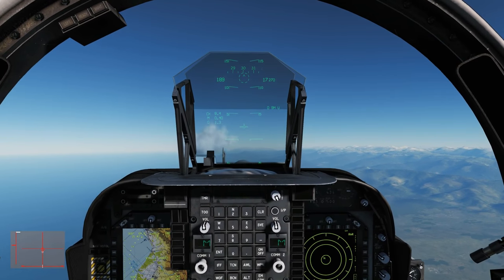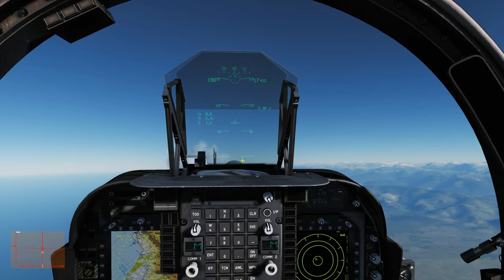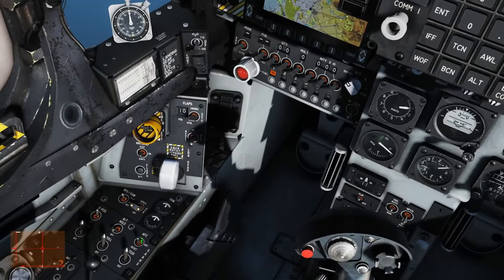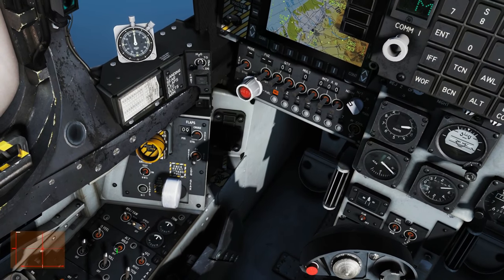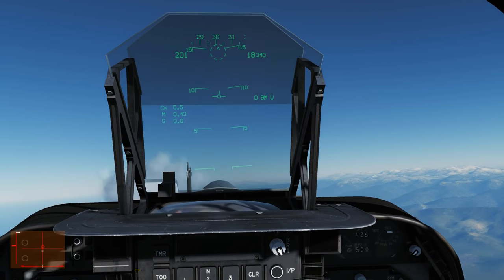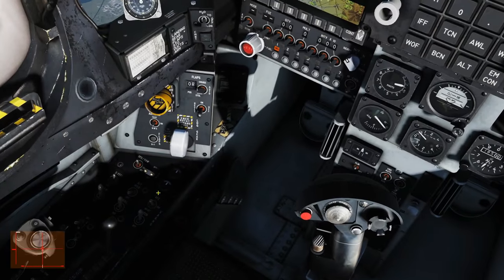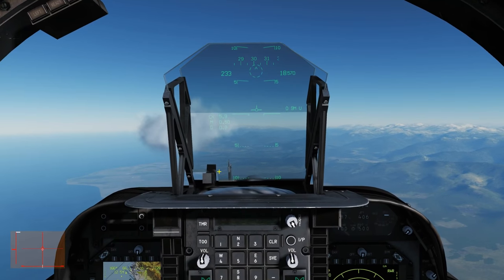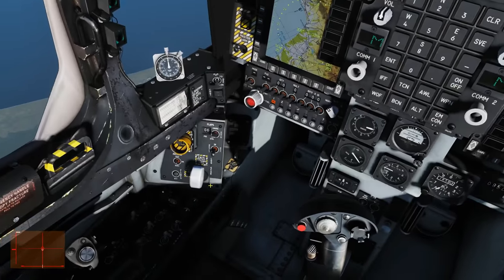We have to be within certain limits to engage altitude hold. If I'm up at 10 degrees and try to put altitude hold on, it physically will not engage — I'm clicking the button and nothing happens. I have to have the aircraft roughly level already for the button to work. Back near zero, I turn AFC on and now it works.